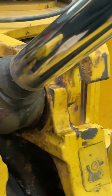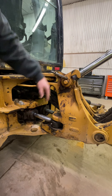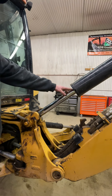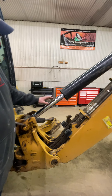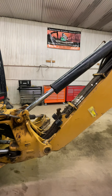This is what I mean by a protector — it's got a cover over it, zip-tied on. We have no idea how that hose looks under there. Now's the time to take it apart, slide it back and forth, move it around, and check that hose out. You've got multiple pins here, and you've got cylinders — two swing cylinders and a boom cylinder. You're checking for oily residue, making sure the rod isn't scored or marked up. The reason you don't want a marked-up rod is that when that rod moves inside the cylinder, those marks will destroy the gland and eventually that will need repair.